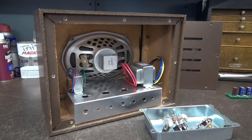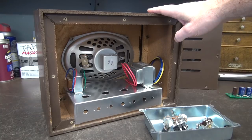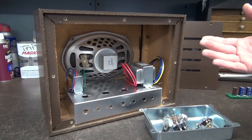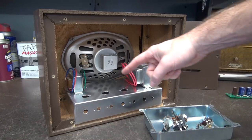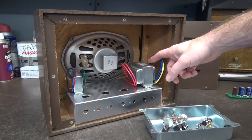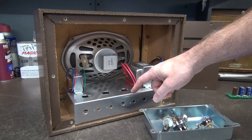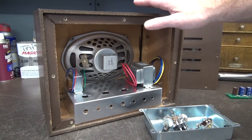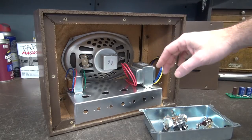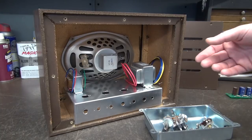I've probably built 3 or 4 of this style of amplified speaker for guys in the past. What's really nice about this design is it's very inexpensive. That output transformer is about $15, the power transformer is about $30, tubes are a couple bucks a piece, and the chassis is about $10. The hardest part is locating a nice cabinet. I like this design because it has a 6x9 speaker — they're readily available, cheap, and they sound great.